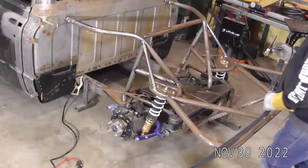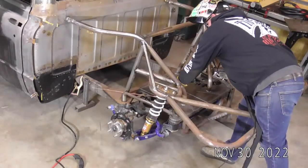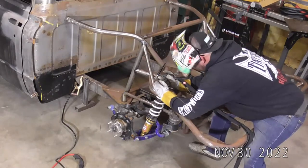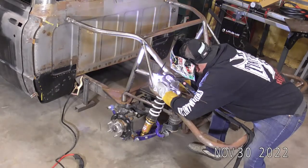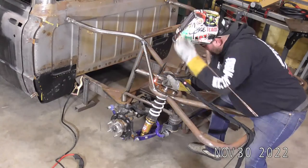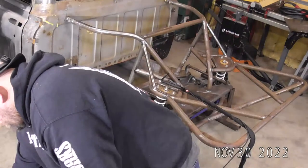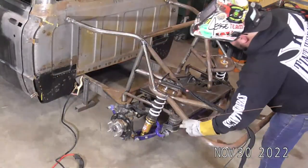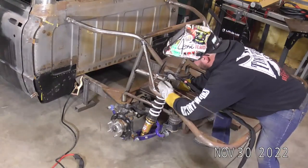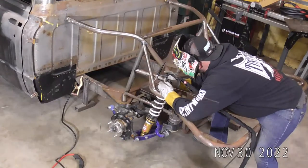Let's see. Actually, I already wiped down this 3/32. So I've got some 3/32 that I'm going to run on this bigger plate. We have to bump the amperage up just a touch on that, so I'm going to go up to 210 amps. Being that I am running this 9 torch, I've got to be a little bit mindful of the heat in the torch, but running the pulse, it's not going to be like we're running straight 210 amps through this 150 amp rated torch. So not quite as bad as a straight amperage.